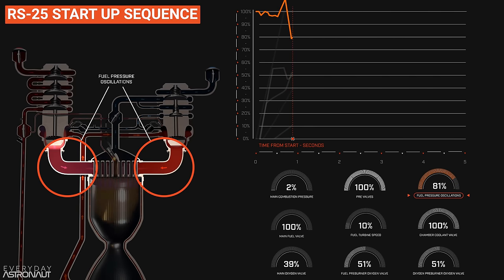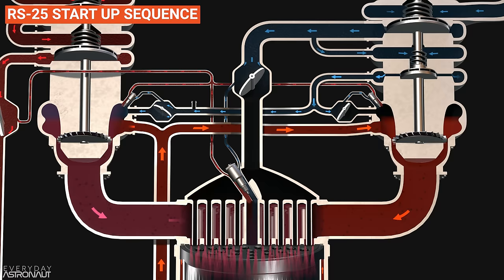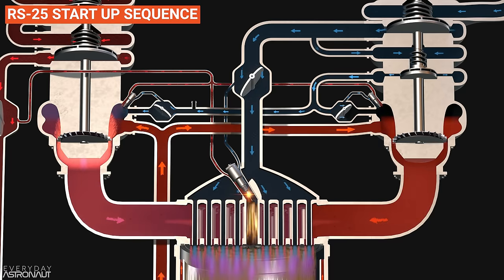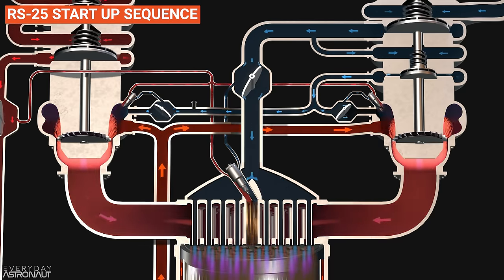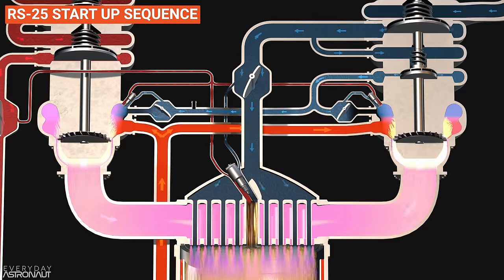The moment the start command is received, the first thing that happens is the main fuel valve is fully opened — this valve actually takes about two-thirds of a second to fully open even at maximum rate. At the same time, the ASIs are powered up and ready to ignite any propellant they come in contact with. Ignition of the ASIs needs to happen before any mixed propellants are present in the system. The components downstream of the main fuel valve are still relatively hot compared to the liquid fuel, and this energy from the latent heat of the engine is enough to begin spinning the turbine — the engine initially starts up as an expander cycle engine, bootstrapping, but it's facing some pretty major thermodynamic instability.